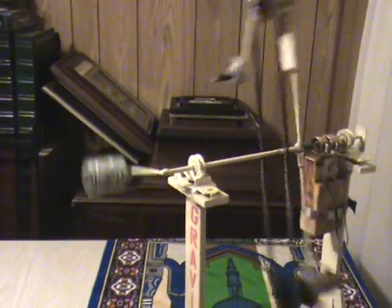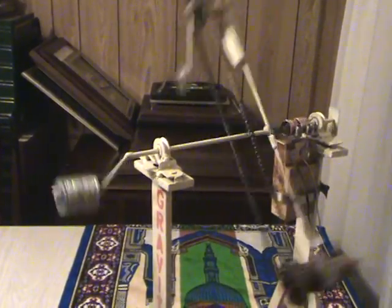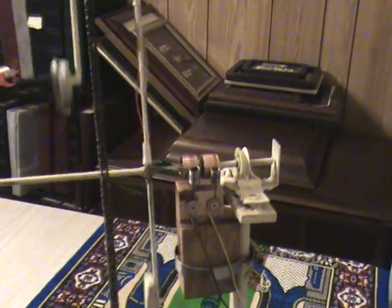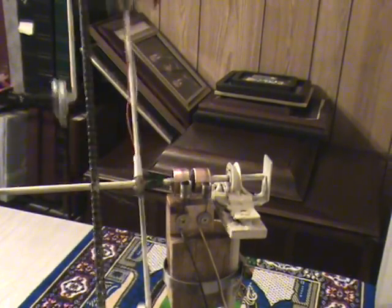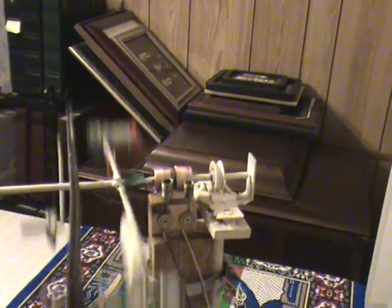We will go ahead and show you the construction once again. The small DC motor is geared and works at around sixty RPM. The commutators — I built two copper tubings, pushed them over a foam wheel. The two springs are my contacts. This is where my feed comes from my wall adapter: seven point five volts.